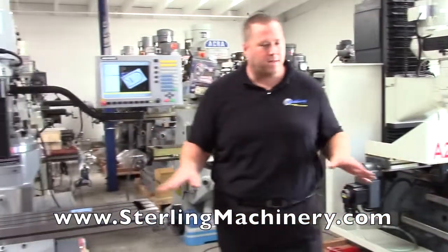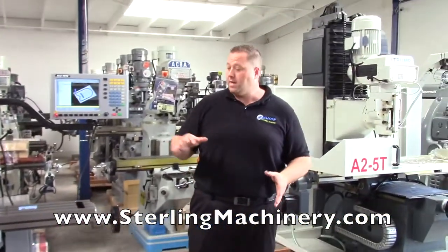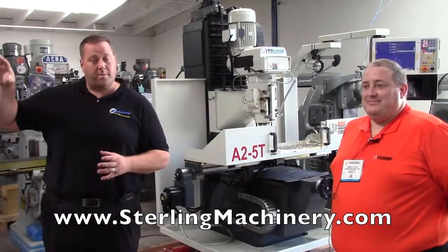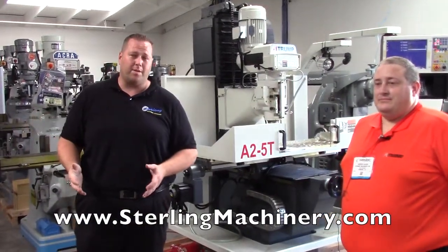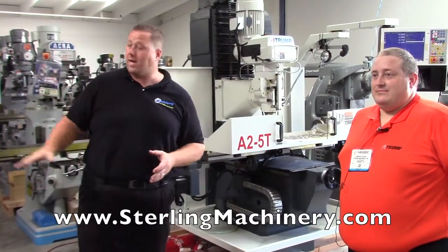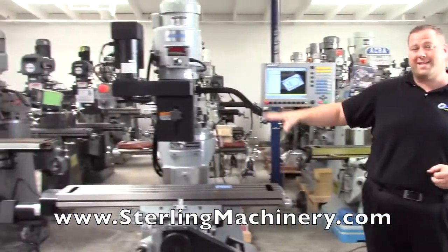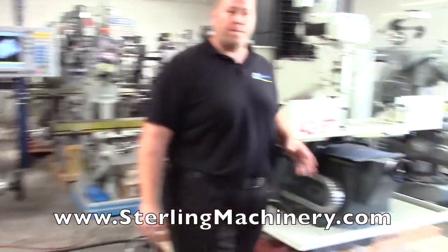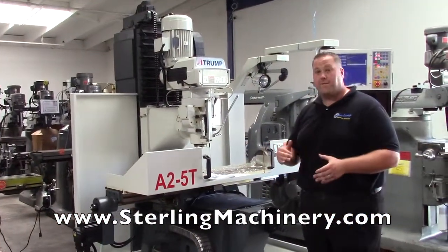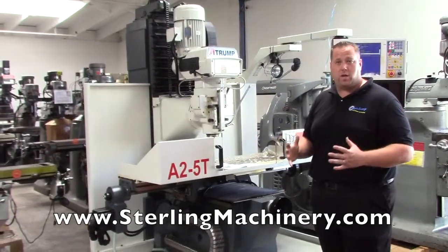I know these are two different size mills, and there's a lot to compare between them. A lot of our customers start with maybe a mill drill, which is the most basic small type of mill you can have. They move into a knee mill — more of the Bridgeport style — and go into a three-axis or two-axis CNC knee mill. Then you'd probably move up to the bed mill, which is going to be the largest type of mill aside from going into the full-size machining center, which would be a totally enclosed item.